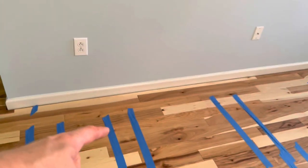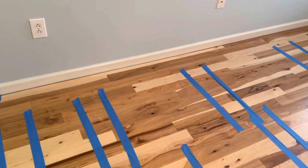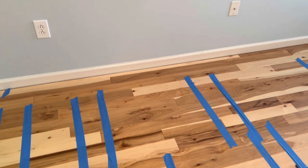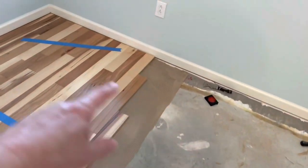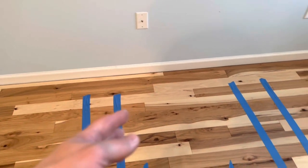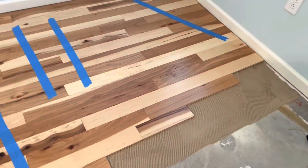So today we simply glue 23 inches at a time. I'll show you — let me turn around. I work 23 inches at a time because that's just how it falls out. I usually do a couple feet with an inch or so variation. I don't want to have to reach way over my glue to get to it. So from where I started, I measure 23 inches, spread the glue, cover that up with wood, measure out another 23 inches, pop a line, cover that with glue. I spread and cover, spread and cover.